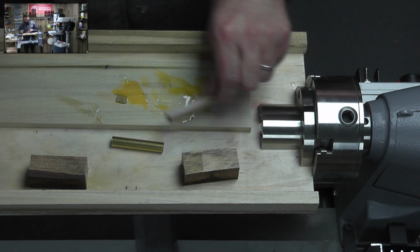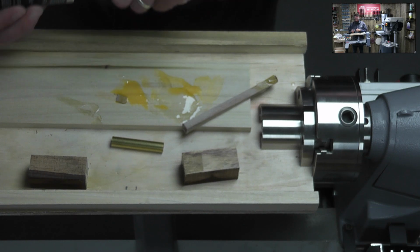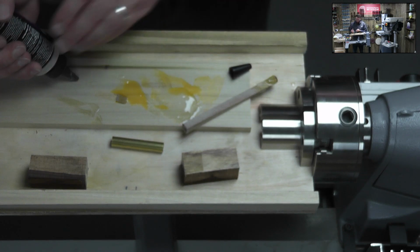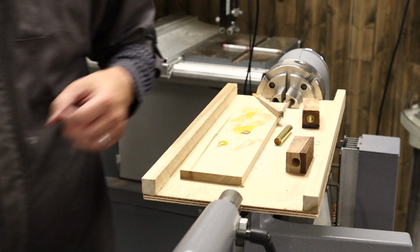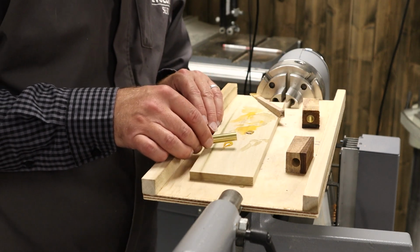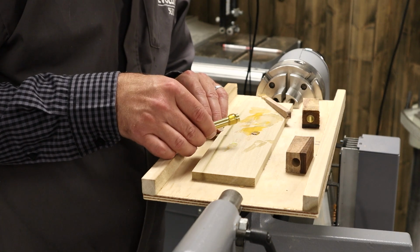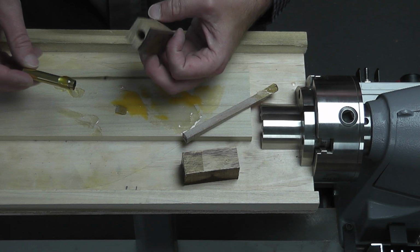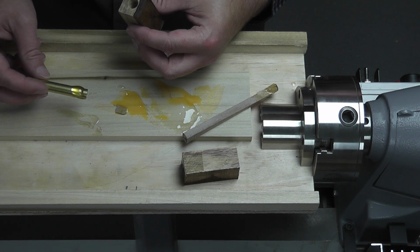So polyurethane, I'm finding a new patch on my board here. I don't want the glues to mix really, and that should just pull off. And this stuff is activated with moisture, so it's kind of like an expanding glue. It foams up like the stuff you get at home, the DIY foam expanding glue. This stuff reacts with moisture and goes off. So we've got a good splodge of glue on there, a good amount on there.